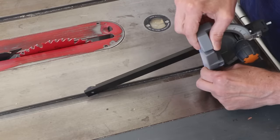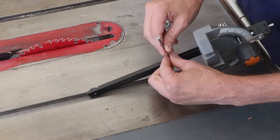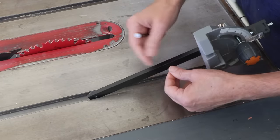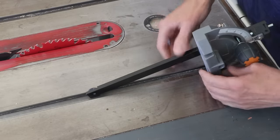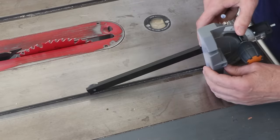There's also an old-school method for tightening up a loose miter gauge. You just take a nail or a nail set and pound it in a few places along one side. What that does is it creates kind of a crown as it goes in — it pushes up a little bit so you've got these small dimples that should make it fit better. And if it gets too tight, you can just sand those down a little bit.